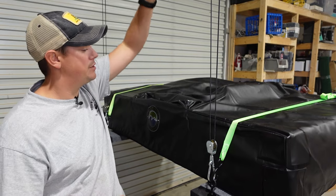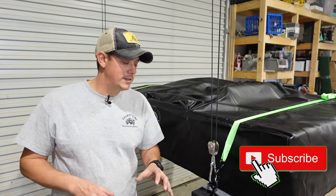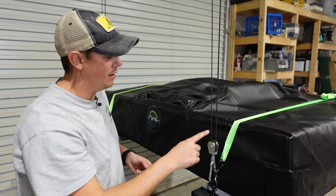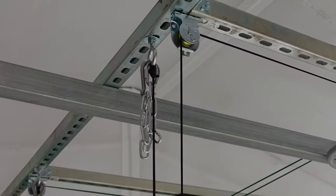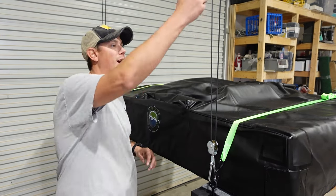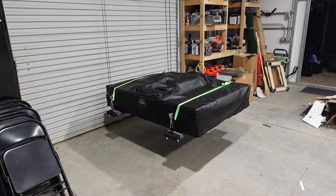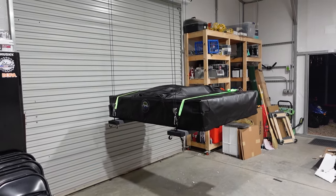So there's a couple different ways you could set this up. You could just have one cable come down to your eyelet that does all the lifting, and I did try that at first, but then I realized there is a better way that's not going to put near as much stress on your winch. So what I ended up doing is having my main line come down here to a pulley at the bottom that's then connected to our lift, then our line goes back up and ties off to a stationary position. If you're familiar with mechanical advantage and how pulleys work, you may understand this. My rooftop tent is only 160 pounds, so that's not a ton of weight for this system, but by having our main line come down, loop around a pulley at the bottom, and then back up to a stationary position, we're effectively cutting the amount of force needed to lift this in half. By doing this we're putting a lot less stress on our system and doubling the amount of weight that we can lift.